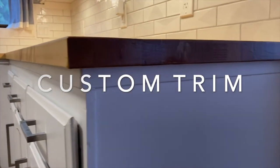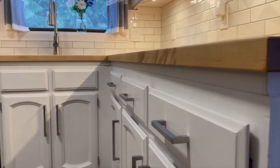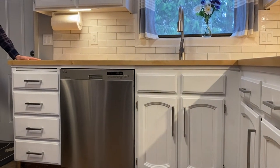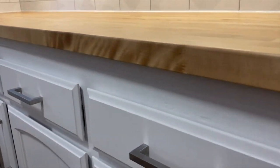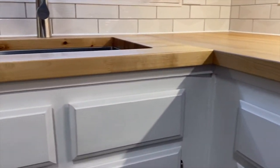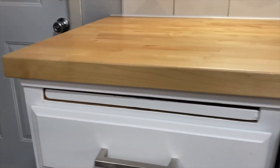What I ended up doing was rounding up some custom trim. I took quarter-inch plywood, cut it to the space I needed, ran it all along, and then just painted it white — it really blends in. That just goes to show that if there's a gap or an issue, very often you can use caulk or some sort of trim to hide it. That's the beauty of doing good finished carpentry.